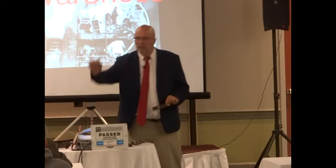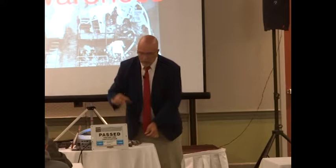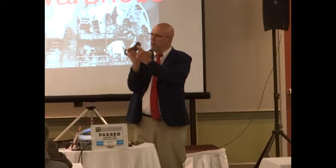Railings, everything's quarter inch thick minimum, grating, and all of a sudden it becomes 3/4 to 1 inch of rust. So 1/4 inch of brand new steel, you leave it alone for 50 to 75 years or more, it'll give you 1 inch of rust on any connection that you want. And inside that connection, there's the head of a bolt, the tail of a bolt, a nut.